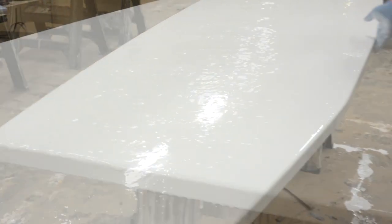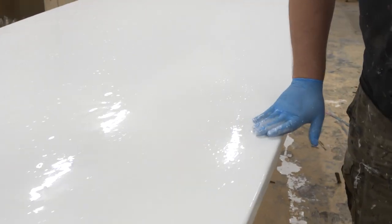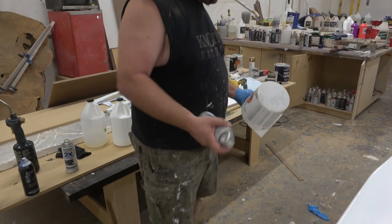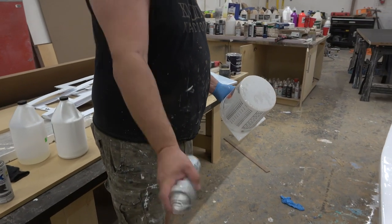Now that I've got all the white spread out, I'm tapping this out with my glove. The reason I do that is I want to eliminate all surface tension prior to putting in the color effects, and I want to have as much of it coated with epoxy evenly so when I go to torch it, I don't have any fish eyes. Here I'm showing off my favorite color — smoke gray — and here we go putting in the effects.